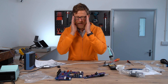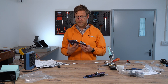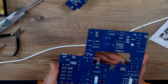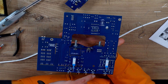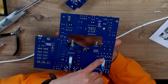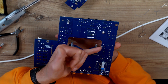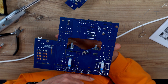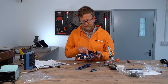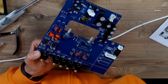So I'm going to check a few things here on the board. First thing: joins — everything has to be soldered. So I'm just scanning everywhere to see if there are any unsoldered holes. There are holes here, but that's in case you want to fit an upgrade cap, so they don't need to be filled in this instance. That area is for an extended volume control — so if you want to use your own, there's a hookup for that.